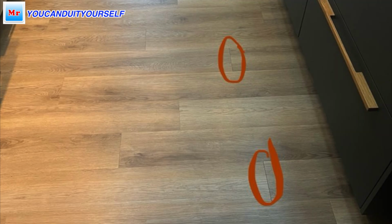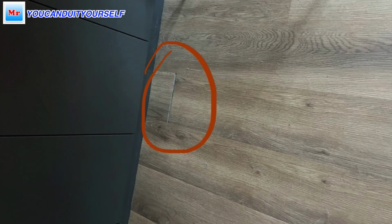So it's not possible to do it like this. This type of installation, island and kitchen cabinet over the floor without any holes for legs, you can do if it's a glue down floor or nail down floor. But if it's a floating floor, you need to install the kitchen cabinet first and then do the floor installation, or you install the floor and make the holes a little bit bigger than the kitchen cabinet legs to have some movement gaps, and then it will work very good, and boards will not separate. When people are walking, the floor vibrates, not level, and you will get this problem with the floor.